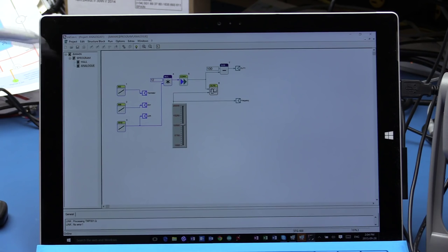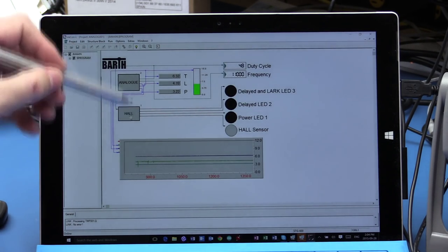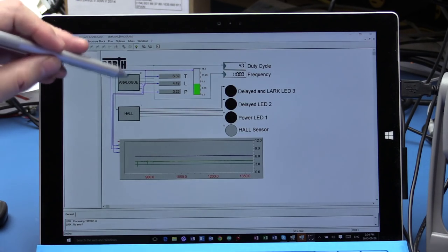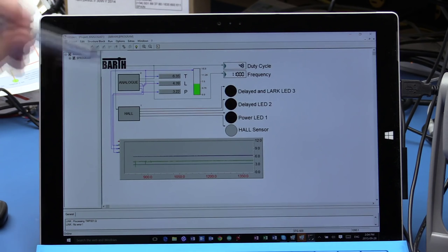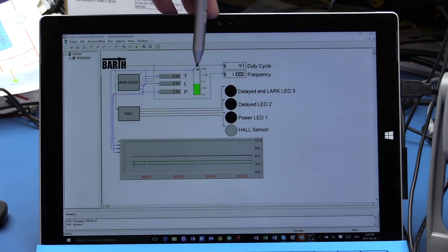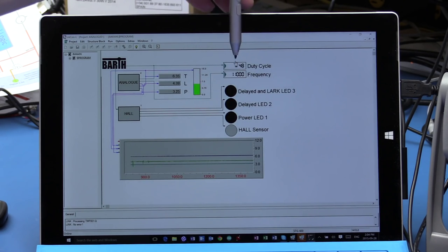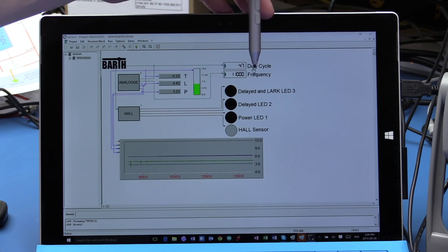The main program takes these two macros as subflows and simplifies them into blocks — one for the sensor and one for the analog. You expose the outputs so the parent screen can use them. I have three basic displays showing sensor values, a filling bar graph, and the duty cycle and frequency shown as seven-segment displays.